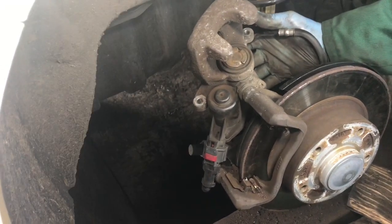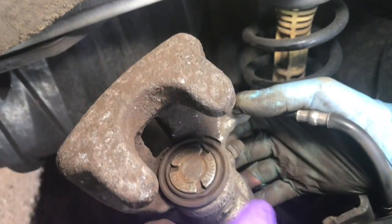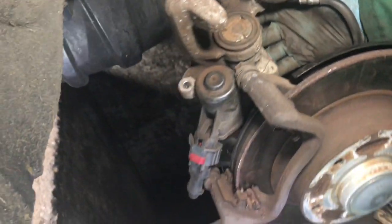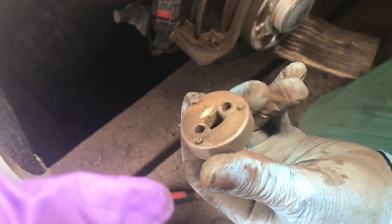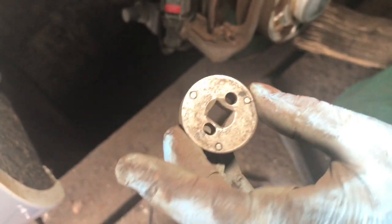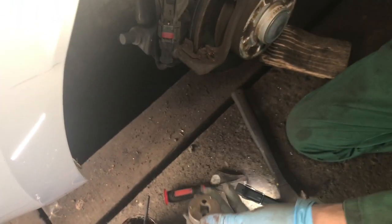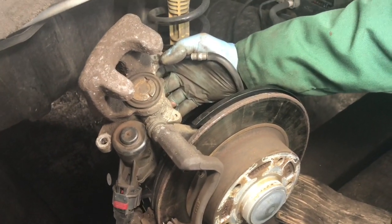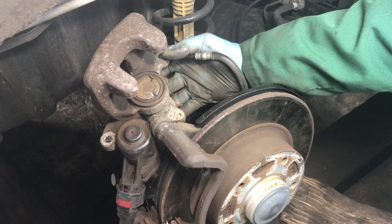Because we've already got it in that mode, the tool you have to use to retract the rear brake — you can see it's got three little cutouts. The one we found was for the Volkswagen; we originally got that for a Volkswagen Passat 2009, and that fits into this Renault and pushes it back in. But you have to be in maintenance mode in order to get it to retract — it is impossible without putting the diagnostic scan tool on it. We'll just put this back together and then I'll show you how to retract these.